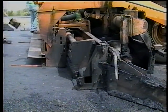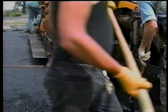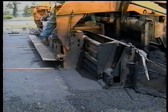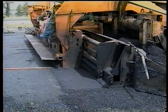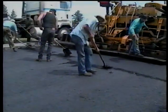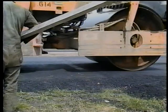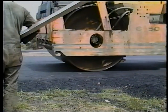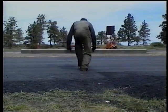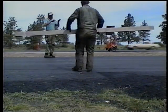The primary concern when paving resumes is the transition between the previously placed mat and the new mat. The crew typically places small strips of wood under the screed to make up for the difference between compacted depth and loose depth. After the paver goes by, see that any excess material is removed. Now the joint can be compacted. Checks should be made with a straight edge to ensure that the transition is smooth. You should observe this check and have any high or low spots corrected.